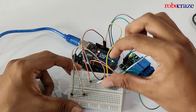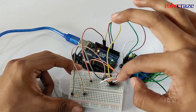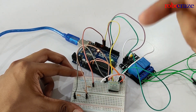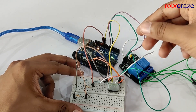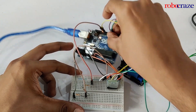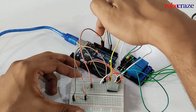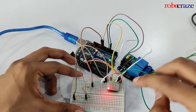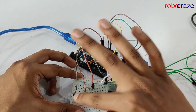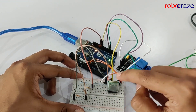The HC05 module has 4 primary connections. The orange cable is the VCC and the white cable goes to ground. The other two connections are the RX and TX, which are used to communicate with the Arduino via UART communication. The TX goes from port number 10 directly to the TX connection on the HC05 module. The RX connection however goes through a voltage divider circuit, because the HC05 module operates at 3.3 volts — otherwise the module tends to malfunction.